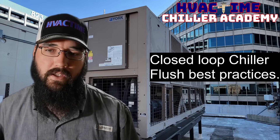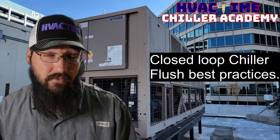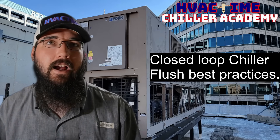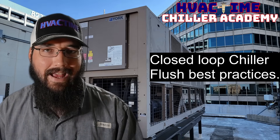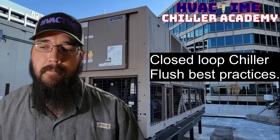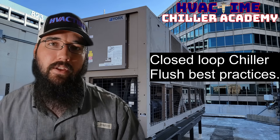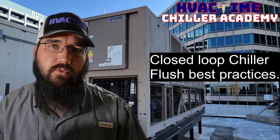Either way, when you want to do a flush on a closed loop, we want to be very careful with how much we flush and when we do so. This is specifically because of the chemical treatment in there. It's very important that our closed loops be chemically treated — they have what's called a deionizing compound added. I'm not a chemist, but the point is there are certain additives put in the loop. That's one reason why it sometimes looks pink. Those additives are preventing things like rust on the internals of the pipes.